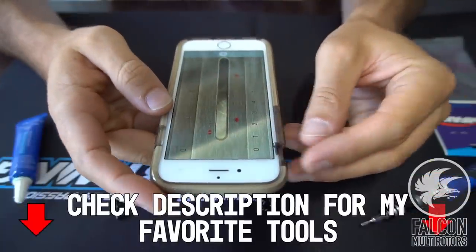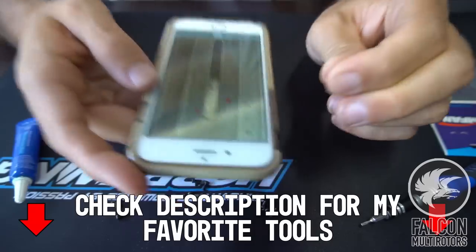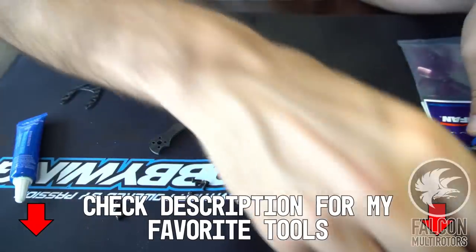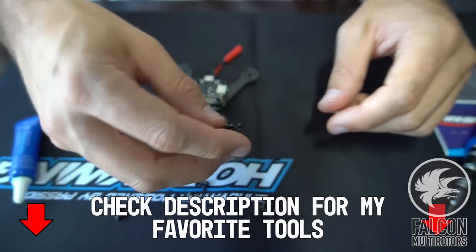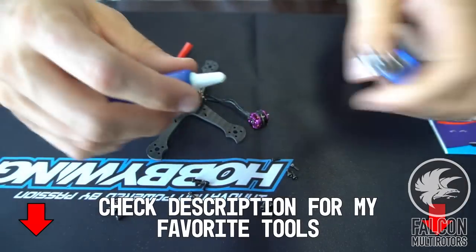All right, so we're gonna get our motors mounted onto the frame now. We're gonna be using M2 by 5mm screws. These are the button heads. And when you're mounting these little tiny motors, make sure you still use Loctite, because these guys like to wiggle themselves loose. A lot of little vibrations on these motors, so always make sure to use a little bit of Loctite on these mounting.